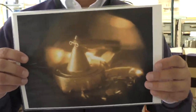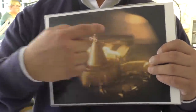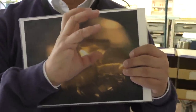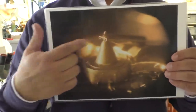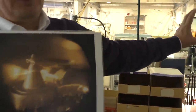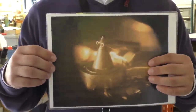The next step is to make the other end, to make a trumpet, put a magnet inside of the cantilever, and put a rubber ring suspension on top of the trumpet. After that, the complete cantilevers are taken, oriented and put inside of the plastic part. Then you have a complete stylus after that. That's also done by the new machine.